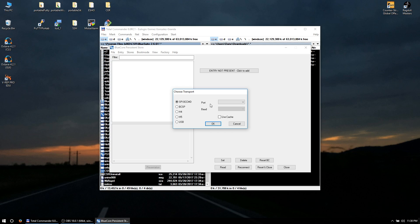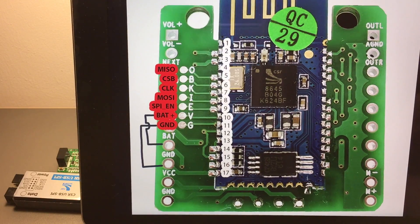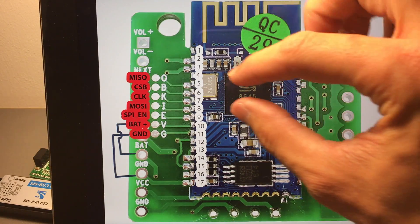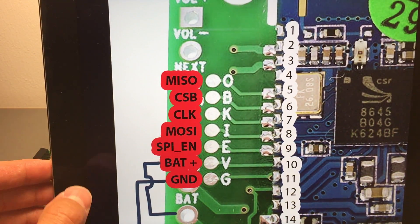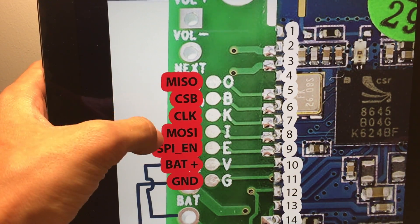Now that we're at this stage we have to connect the board up, and this is by far the trickiest part of the entire process, although not too difficult - it is quite finicky. Let's get back to the table shot. I've made a schematic here, so basically this is what we're looking at. The pins are numbered, 40 in total. On modules that have the 12V DC-to-DC converter you will have this breakout over here.